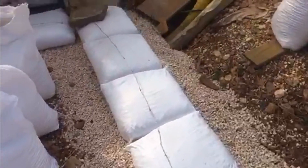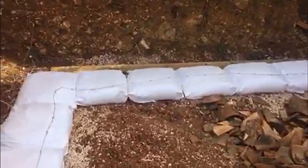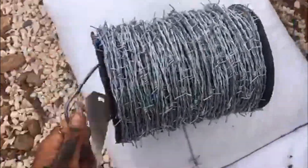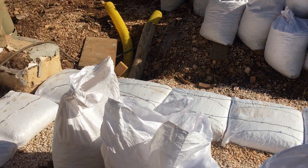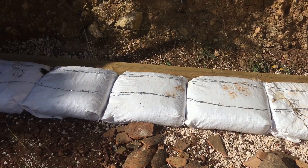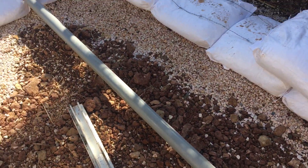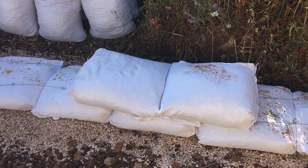After your first course of gravel bags, apply one continuous ring of barbed wire all the way around, followed by a second. You can fix this to the bags by pressing the barbs into the bags or by using a heavy stone on top. Next, apply the second ring of barbed wire in a continuous loop, joined at the beginning to give the building its tensile strength and to stick the bags together like mortar. This is also your opportunity to lay in pipes which will be under the floor level.